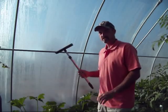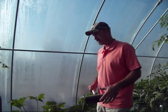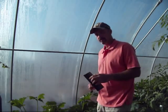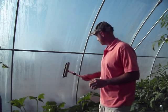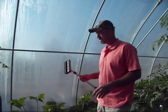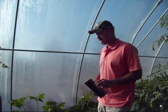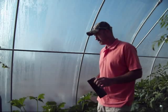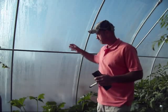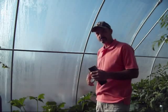Hey guys, it's time to put my second layer of plastic on. As you can see, the condensation is pretty thick in here this morning, and that cuts out a lot of the light coming through like last week. This is the south wall right here, and it was so cool outside that the condensation basically never came off. That's how much sunlight is being prevented from coming in. The idea is to put the second layer of plastic on and get an air pocket between the two layers, and that should cut down this condensation.